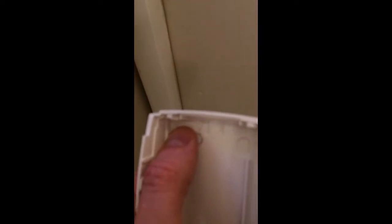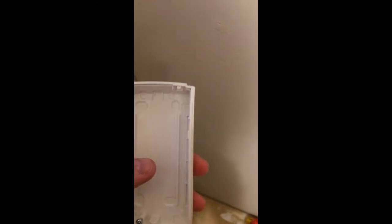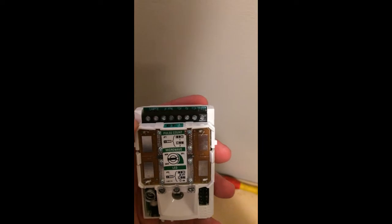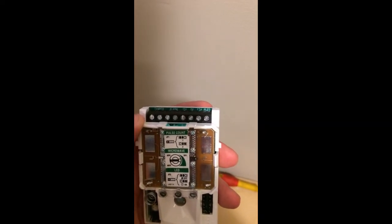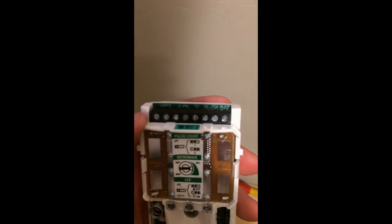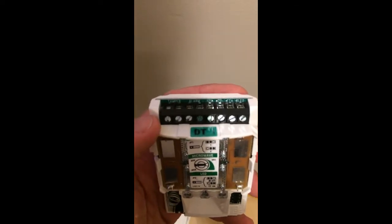I would knock out, using my terminal, a small hole here where they've got thinner plastic, and then at the bottom — you can just see that down there — is where I'd also be knocking through using my terminal to mark a little hole in the wall, then drilling about an inch deep using my masonry drill bit, or a multi-construction Bosch drill bit, which is good. That will then use a red wall plug and an inch-eight screw. You can use a three-quarter-six if you'd like, but I generally use an inch-eight.